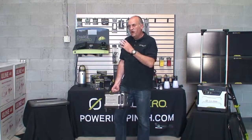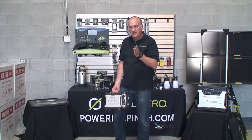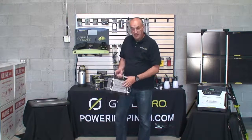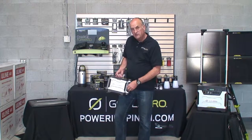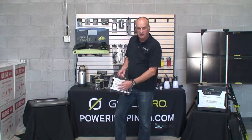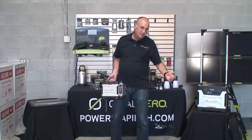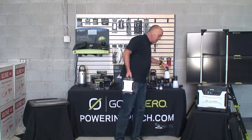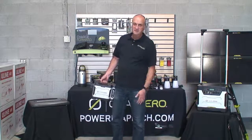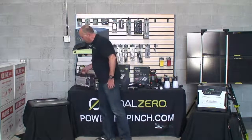Okay, so again, their wattage is based on an hourly, trying to put it in terms people can understand. That's how many watts it will produce for 1 hour of time. It's called a watt hour. Again, this is 350 watts. Has a 400-watt inverter, so if you put something 400 watts running out of it, which it will do, it would last 45 or 50 minutes is all. So keep that in mind. Yet if you ran lights in it, we talked earlier about these lights that only draw 3 watts. You could hook 4 of those up. They run 12 watts. You could go for days without ever recharging the battery. So that's just a little bit more about the wattage.